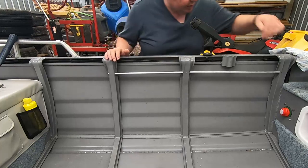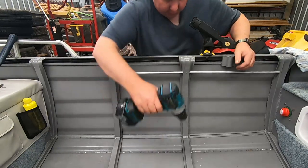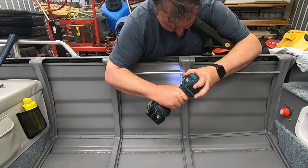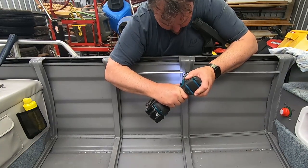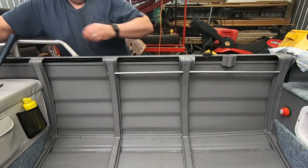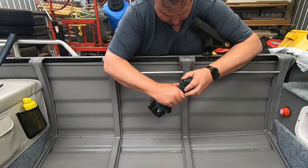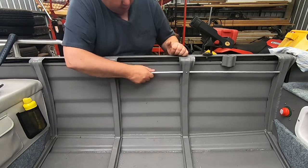And that has bottomed out onto the back of that side. That's pretty solid, probably doesn't even need a screw, but I'm gonna just drill a little tiny hole through here anyway, and I'll put a pilot hole screw through. Watch the middle there. Like that. Bit of self-tapper. If I'd known it was going to be that tight, I wouldn't have bothered, but we'll stick one of these in anyway. Just that's going through this rod now to stop it moving. Like that. No way that can shift.